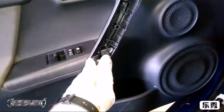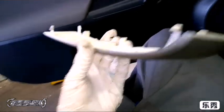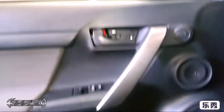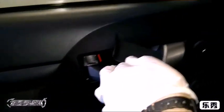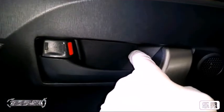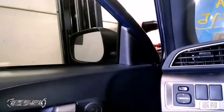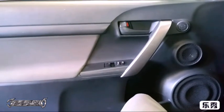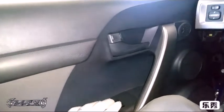Put the long screws back in the handle. Then put this piece back in place - be patient, line it up perfectly and gently push it in. Once it's lined up you can give it a little tap, but be careful with plastic. Put the screw in, this piece slides in - start on that side and push it toward the lock side. Put the cover back on up here - it just pushes in place. That's it! Hopefully this video helped you out. Both sides are working - that's how they're supposed to work. Problem fixed.